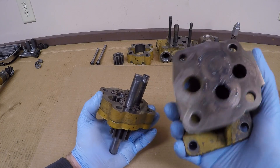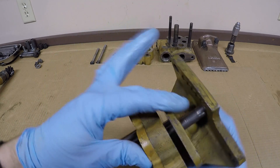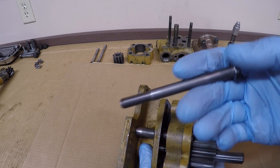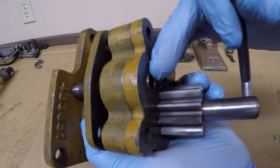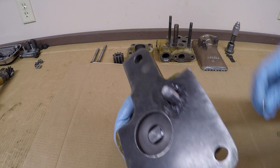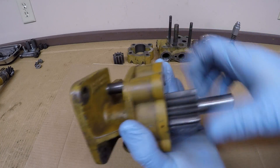The pump body goes on — that large hole surrounds the standpipe. Feed that drive shaft up through like that and make sure the standpipe just starts to engage the hole that it presses into. To seat this standpipe, the method I'm going to use is a 3/8 bolt — you could also use a small arbor press, hydraulic press, what have you, but this is the most convenient and easiest to do on camera. Run the bolt in from this direction — you can see that standpipe is a little bit above the finely machined surface of the separator, so that should keep the bolt from marring any surface I want to keep pristine. Put a little grease back here, pop a couple of flat washers on, thread a nut on, and with a couple of wrenches that will draw the entire assembly together just like that. Check for a good spin.